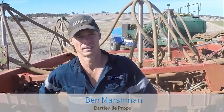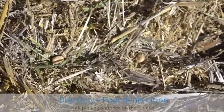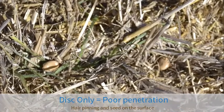What was your impression today of actually putting seed in the ground with the waterjet? Great. We came out here with the intention to give it a good test. It's been a dewy morning with no wind, so our stubble is quite damp and ropey. Where the waterjet cutter was engaged, it's certainly cut through that straw and allowed the disc to penetrate into the soil properly. Where it's off, a lot of the seed is on top of the stubble and we haven't been able to get it into the dirt. But where we've been able to cut through the stubble, which it seems to be doing nicely, it's certainly engaged that seed right into the furrow.